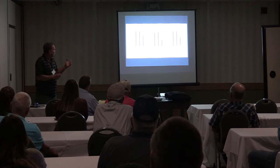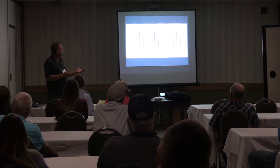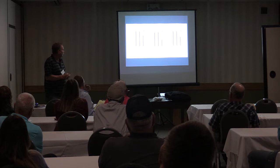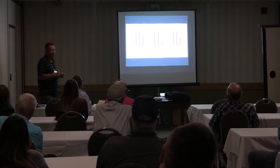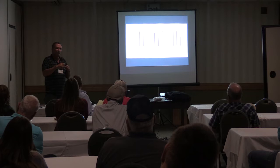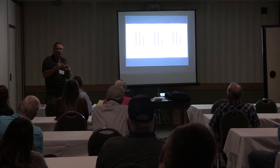We did some work to determine what we could test to see if fire had any impact on older fences. Tensile strength was one thing. We had some wire that was at least 20 years old, and some that was over 30 years old, probably closer to 50. We exposed it to several burns versus unburned in high fuel conditions in tall grass prairie — as hot as you can get with grassy fuels. The other test you can do — because you can't test for zinc coating since it's gone — is a ductility test. You take a single strand, wrap it around an eighth-of-an-inch mandrel or bit, wrap it tight, and look for breaks or longitudinal cracks. That tells you if you can repair the fence — will it wrap up?